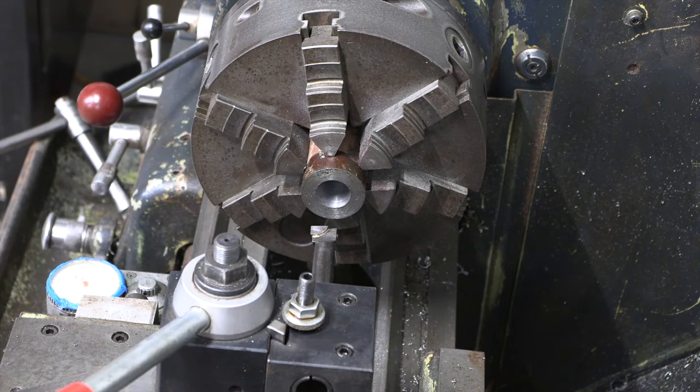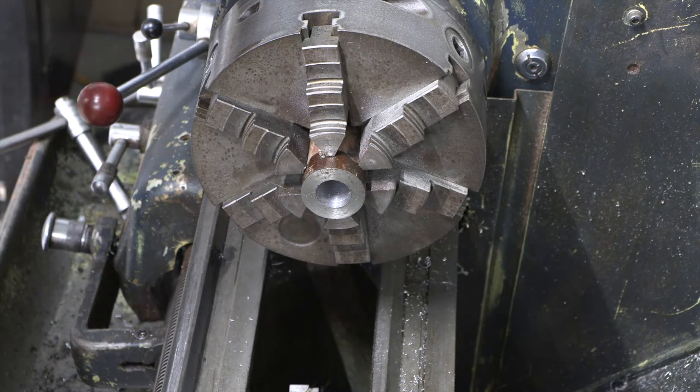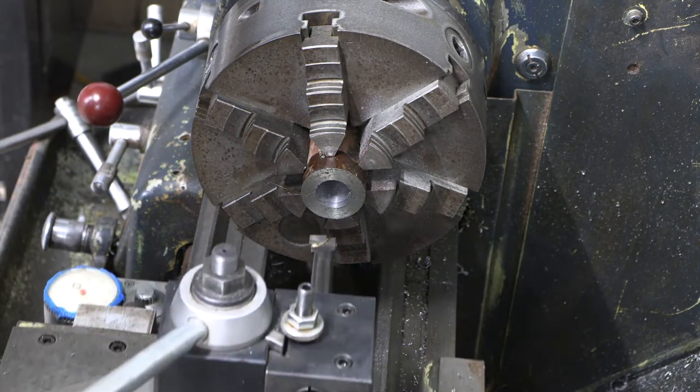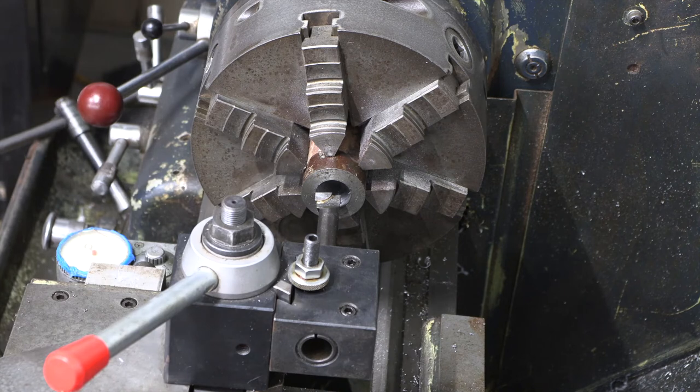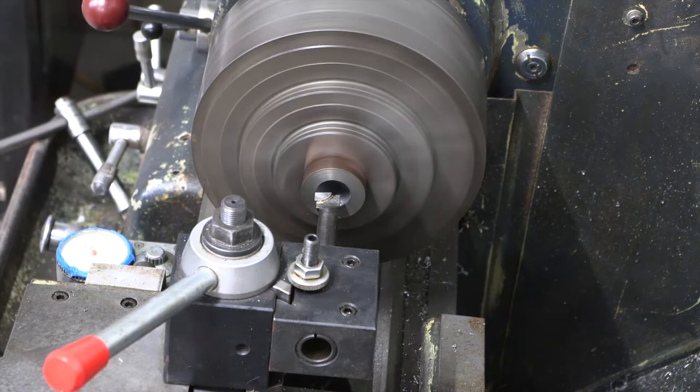Go ahead and get a measurement, and we are 946 and a half. So we are 946 and a half, we need to get to an inch, so that's about 53.5 thousandths that we need to go. I'm going to go ahead and speed this up just a little bit. We need to